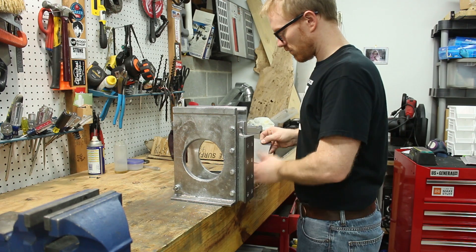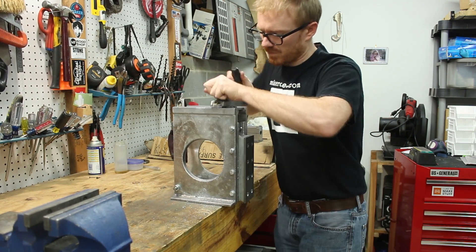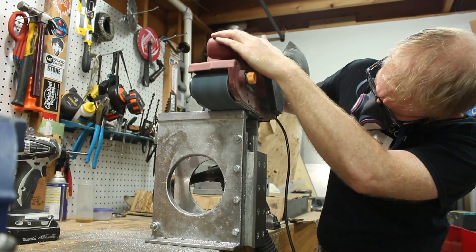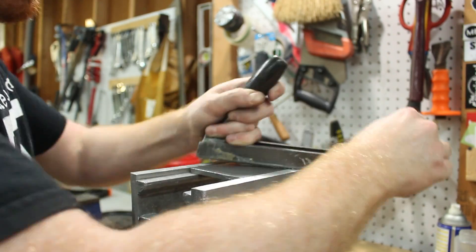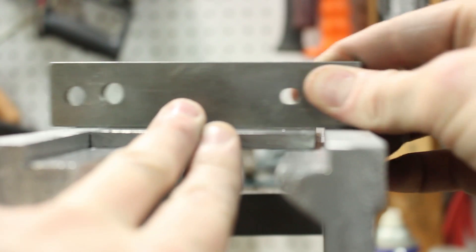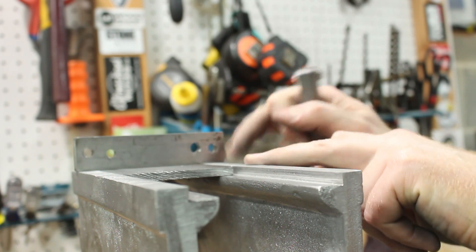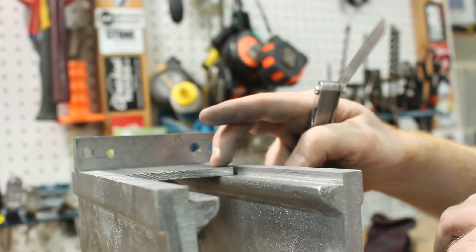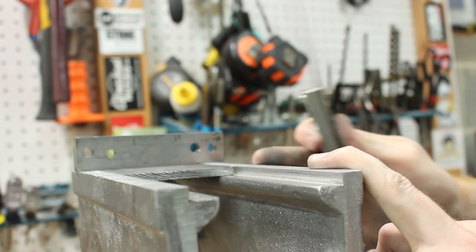Once all the printing looked pretty good, I turned my attention to finishing off the tops of the column sides. I did that just using my little scrap piece of cold rolled as a gauge, and I used a rasp to help me quickly remove material. After that wasn't quick enough, I switched over to a belt sander, which was much faster — I was using about a 60 grit sandpaper belt. Then I finished up with the rasp. I use this little piece of cold rolled steel as a straight edge to check with a feeler gauge how far I've shaved off the column side top where the ram slide clamps will mount. I want these to be a little bit below this surface, but I'm going to scrape these parts, so for the time being I just want to get it as close to level as possible to reduce the amount of scraping I'll have to do.